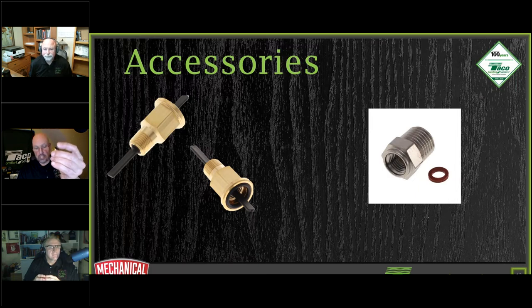What you need to do is basically pull out that bubble breaker. Really easy, just a pair of channel locks. If you take a look at that bubble breaker, it's a little small, and there's nothing really holding it in there. You just pull that out, and then you throw the check valve in there on top. Now you've got a check built into your system itself, so you can easily pull these out.